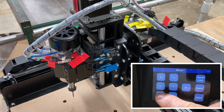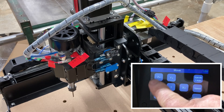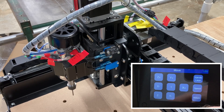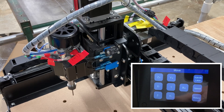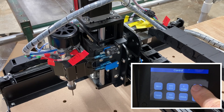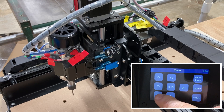And that's all the problem is — it's a safety device. This is the way it works on each one of them. The important thing to remember is don't panic. Let's go back and do this one more time. We're going up. We hit that limit switch, it stops the machine — it won't go any higher. When you see the question marks, realize that's the problem. Hit return, hit reset, you'll see the alarm on. Unlock. Go back to move. Don't forget — put the step in. It will not move unless you have the amount of movement set.